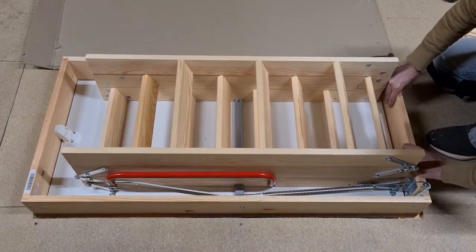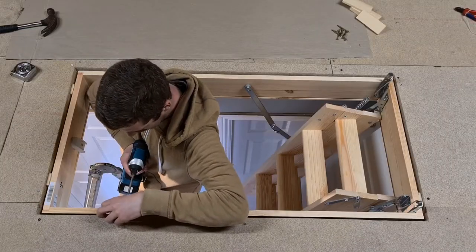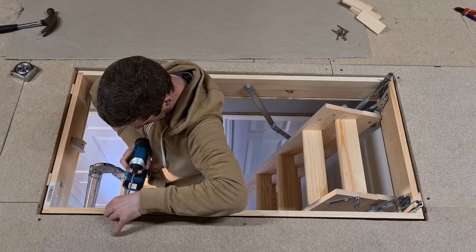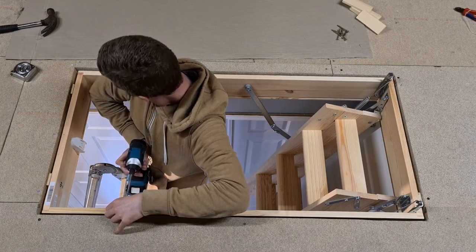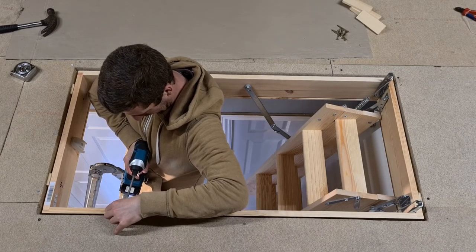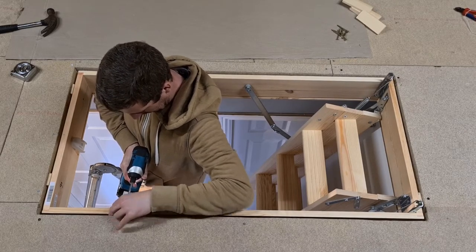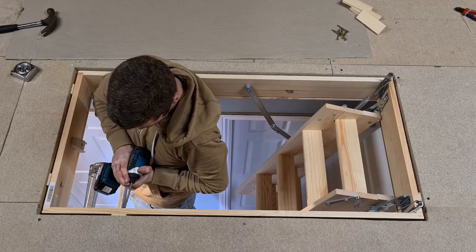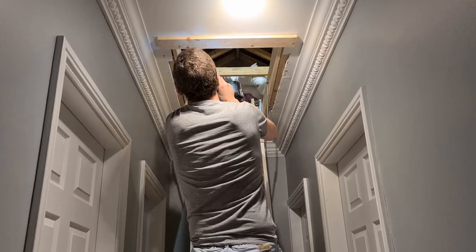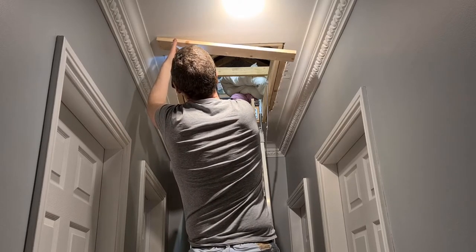Once the ladder is in position and aligned correctly, the attic door latch is opened and it can be fixed to the frame. I use thin wood shims to align and fix the ladder to the frame. Measure diagonally to verify the ladder is square and is in the correct position. Once the ladder is fixed in position, remove the support boards.